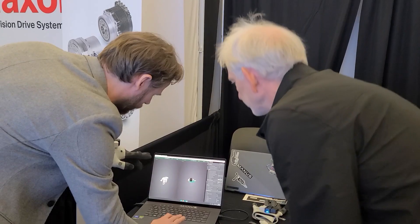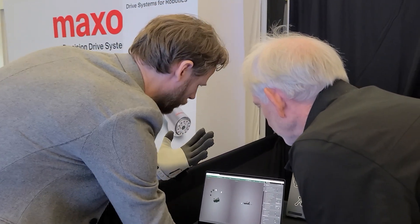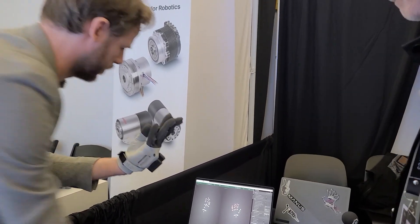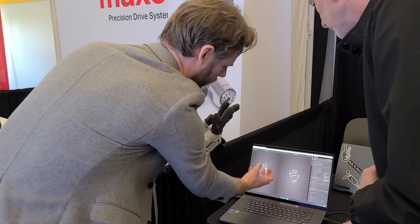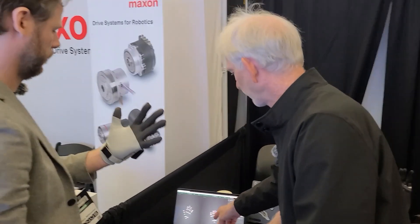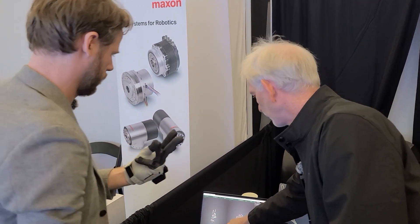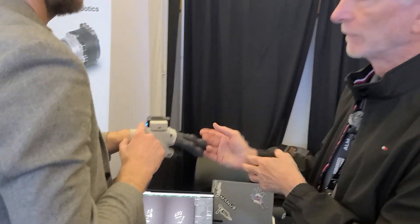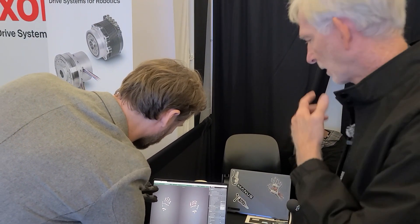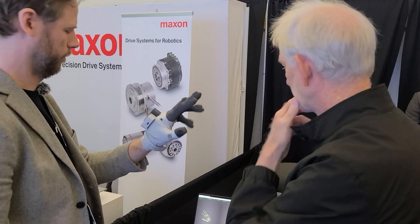Here's what we get for the raw endpoint data — these are the sensors in space. From there we build up the raw skeleton model. These are the quaternions — you can already see the knuckle not only moving but rotating and curling inwards. It's 25 data points — not really 25 degrees of freedom, but 25 locations — and each one is a quaternion and a position in space, so that's six degrees of information at each point. Also the wrist joint is measured in full rotation because of an IMU that sits in the glove.